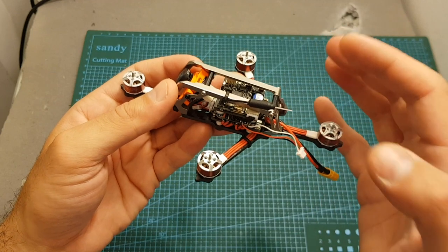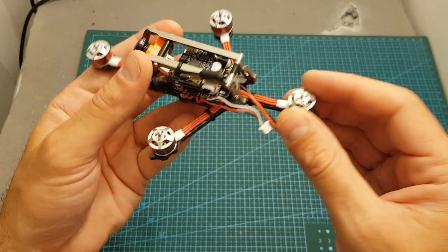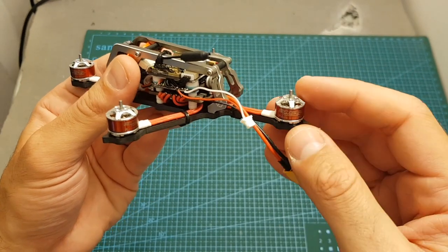So now let's have a look on the quadcopter itself. First of all, the internal components are pretty much similar to the GT-M3. However, there are a couple of differences. First of all, this quadcopter is using the Diatone Edge Racing 1104 6000 kV motors, which are rebranded Sunny Sky